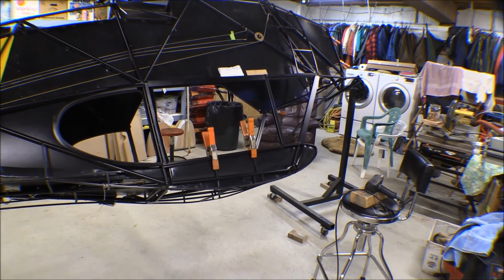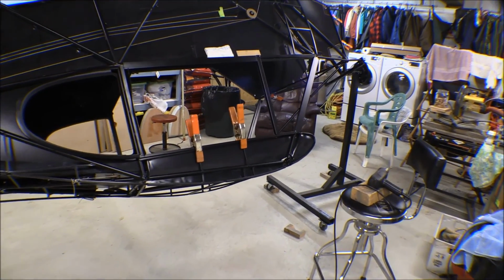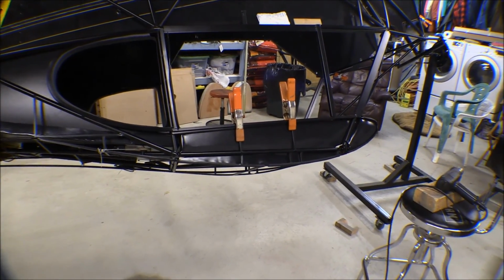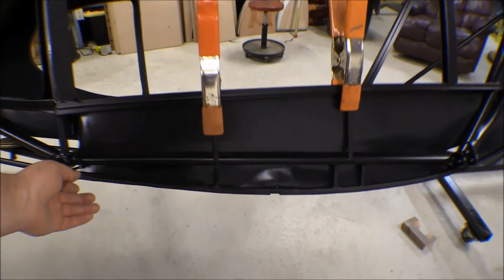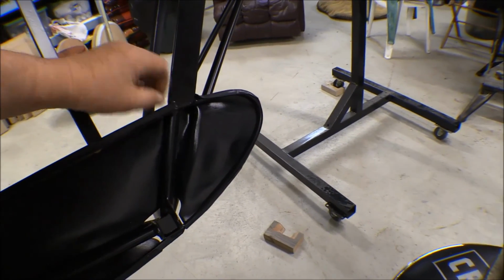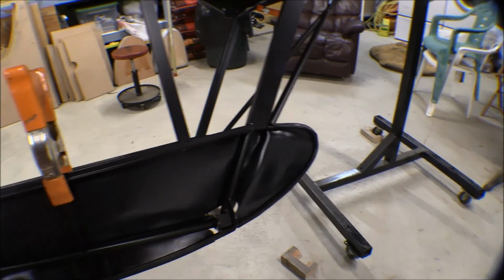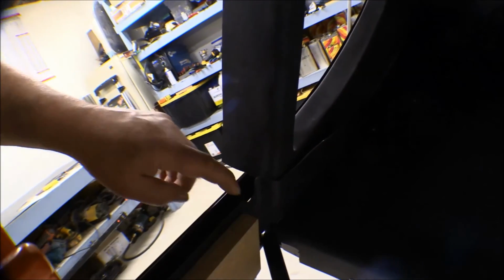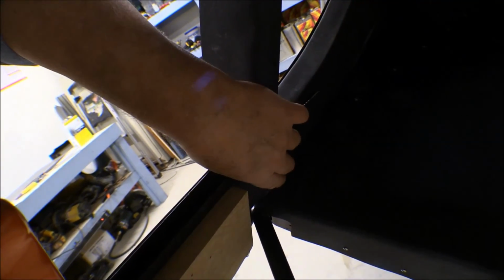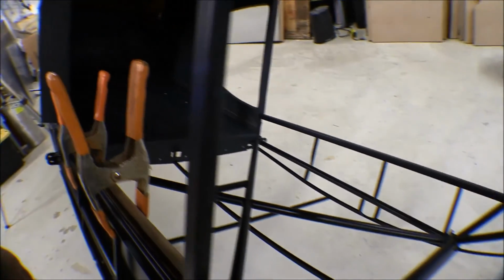We've got the left hand wing root panel just about done. Got it pretty well formed and shaped. Turned over the top up here around this top of this rib and around the nose, got it formed, and a nice little channel here for the wiring and stuff to come into. And then we've got a little dog leg, a little joggle there to go around for the headliner, the baggage compartment headliner, and that's in there. Still need a little bit of trimming on some of that stuff.